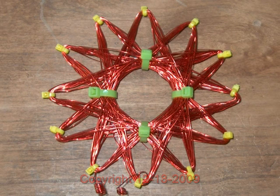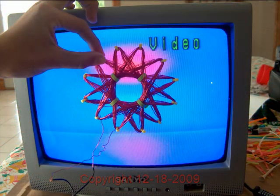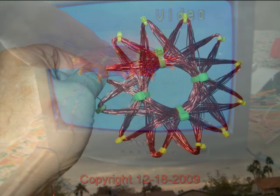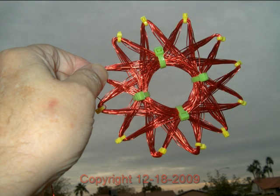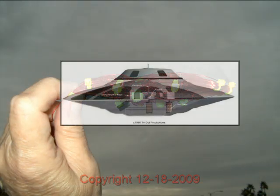These have been trimmed out. I would suggest you also use four ties in the center to pull the winding very compressed. This is a very easy coil to wind. On my next video I'm going to show a computer monitor or video monitor and make it into a magnetic field analyzer. We're running 18 volts into this — just one winding of 21 turns. I'm going to call it better than or equal to a regular coil, but we won't know until we test it against a standard — that'll be part of the next video.